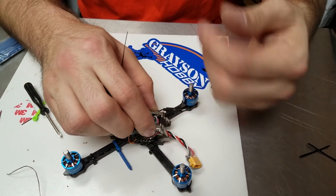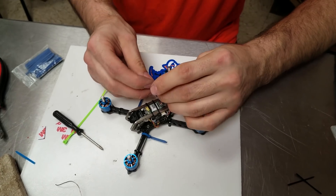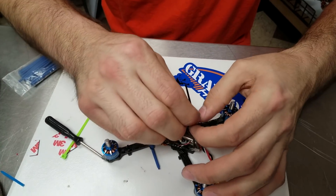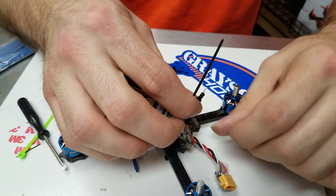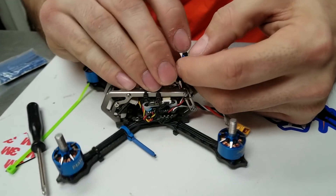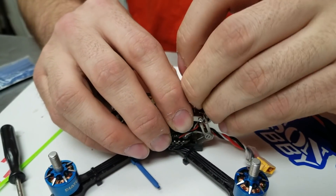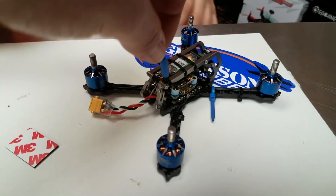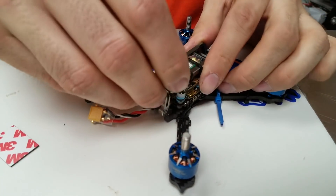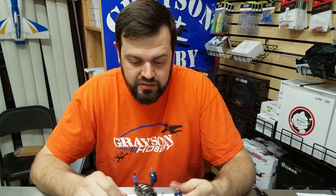The factory just puts a single zip tie on the VTX antenna. I'm actually going to re-zip tie this antenna — zip it up and then put a little piece of shrink tube or tape to hold it up. I've got some blue shrink wrap here. You don't want it super tight to where it's going to pull the connector off — leave a little slop. And that's it — other than setting up the computer, setting your endpoints, sub-trims, and all that, that's pretty much all there is to it for FrSky installs.